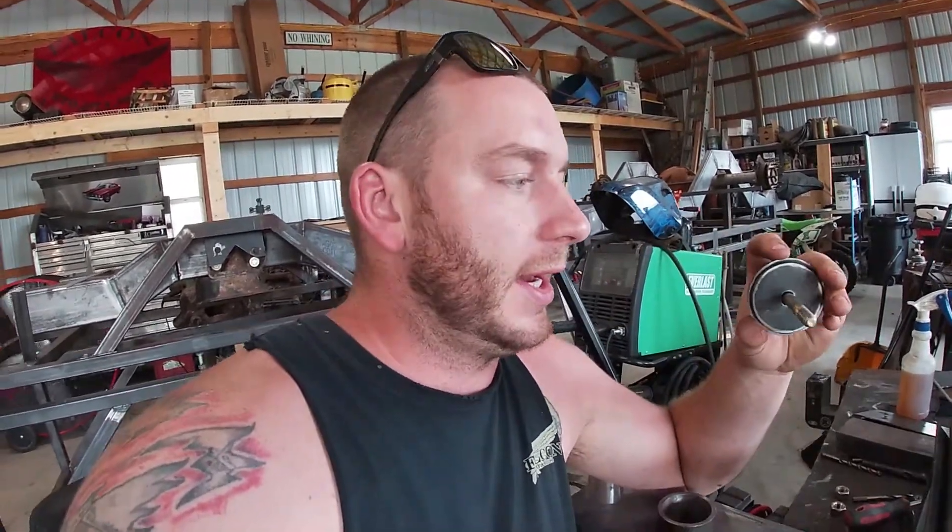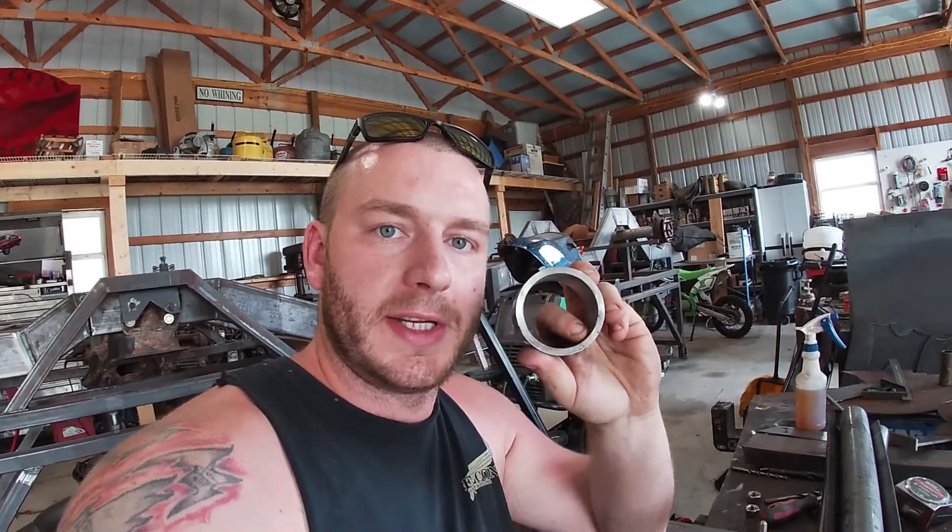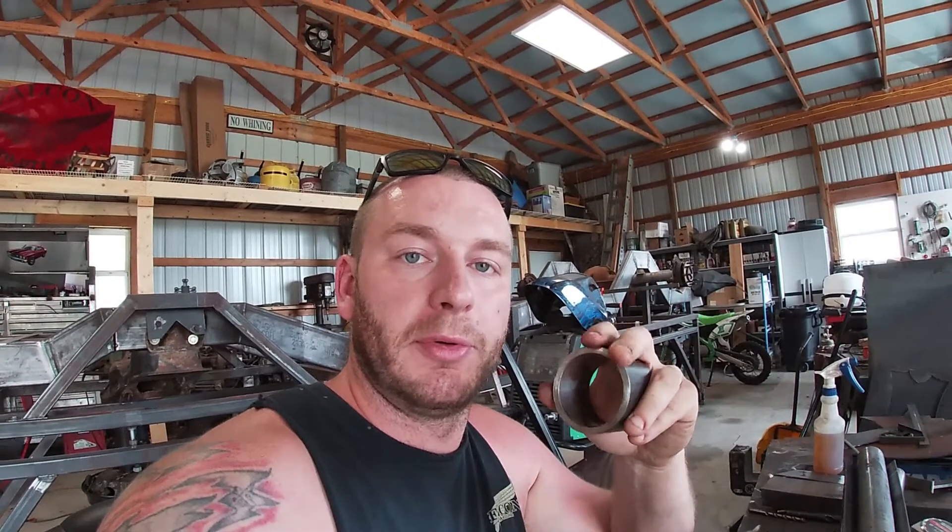On my plasma I actually set a disc, cut it out to the inside diameter of my ball joint pipe. What we did is we bored this out so it has about a 15 thousandths press on the ball joint, so it's not going to go anywhere. I took my plasma cutter, cut a hole with the inside diameter, and cut one that was two and three-quarter inch. What I did is I cut a piece that was two and a half so that it doesn't protrude past the outside diameter and affect the welding or any kind of fit-up. That way it creates a nice tight clamp so that whenever I run my pipes, this ball joint is not going to go anywhere.